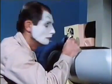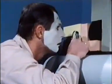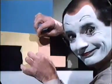Sealing gap? A gap would fill up with fluid — a gap must surely result in leakage. Wait a moment. The seal faces slide on a thin fluid film. This fluid film is hair-thin so that the sliding faces hardly come into contact with each other. The fluid that is to be sealed simultaneously supplies the lubricating film for an optimal sliding motion of the seal faces. That's the answer.